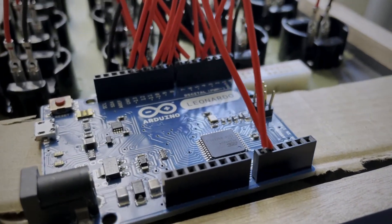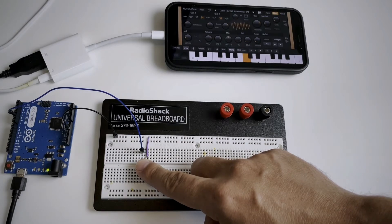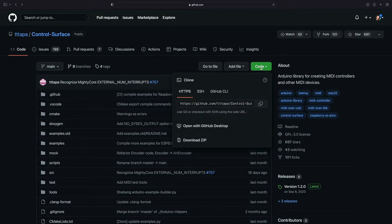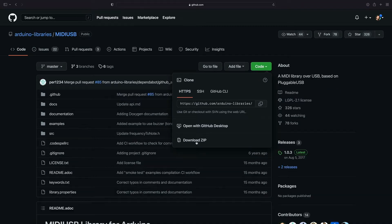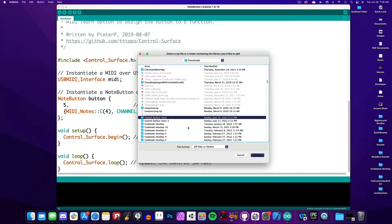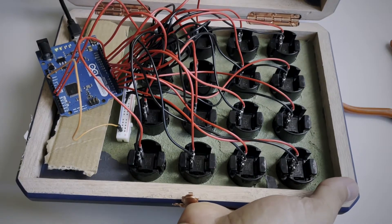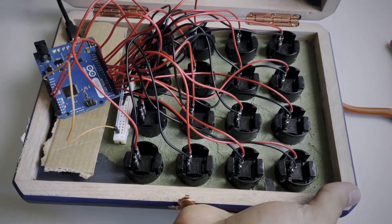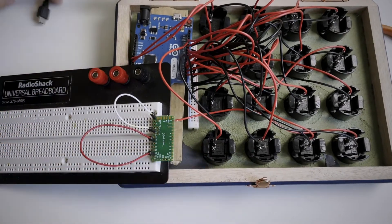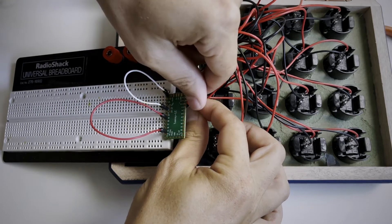Now I'll upload a quick sketch to make sure all the buttons are working. In another video I went over installing the Control Surface and MIDI USB libraries — we'll be using those for sending our MIDI events. I'll leave a link in the description to that video, but in summary you'll need to download the Control Surface and MIDI USB repositories from GitHub and add them as zipped libraries. On some microcontrollers like the Teensy, MIDI USB is already included, but if you run into any compiler errors it's a good idea to add those again. Now to take those input wires and solder them to our Teensy.